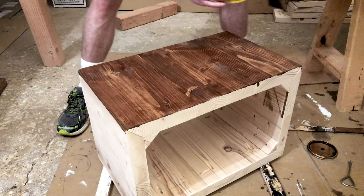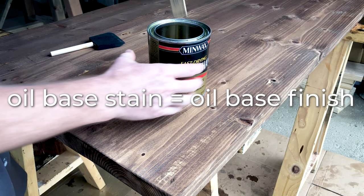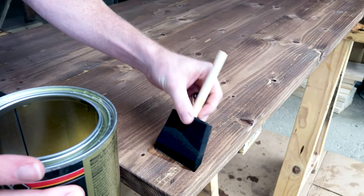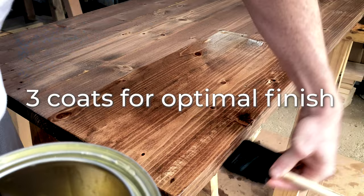I'm going to wait overnight for the stain to cure, and now I'm ready to apply a protective clear coat using polyurethane. This will seal and protect your project from any moisture, food stains, and will greatly increase the overall durability of the surface. Since I used an oil-based stain, I'm going to use an oil-based finish. Applying this will provide a rich, amber finish, but will also reveal any mistakes from the sanding or previous steps, which is why you want to do a good job sanding. I'm brushing this on with a minimal amount of strokes to make the finish as smooth as possible. Once I'm done with the first coat, I'm going to wait 10-12 hours before lightly sanding using 320 grit between each coat. It'll take at least 3 coats to achieve a nice smooth finish that sufficiently protects the wood.